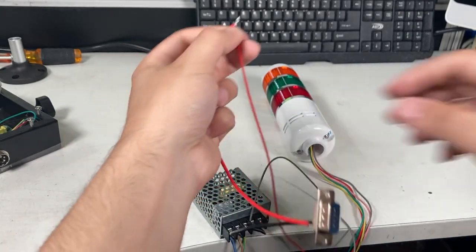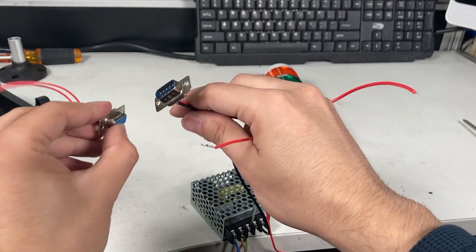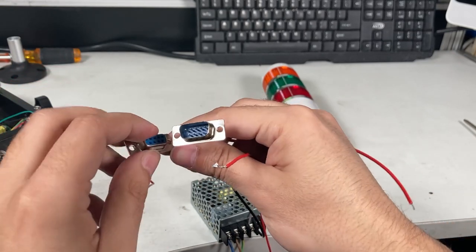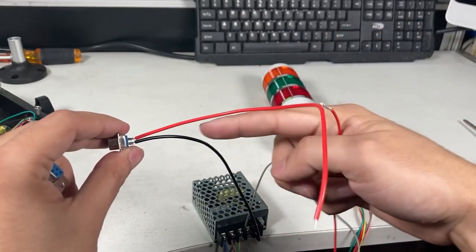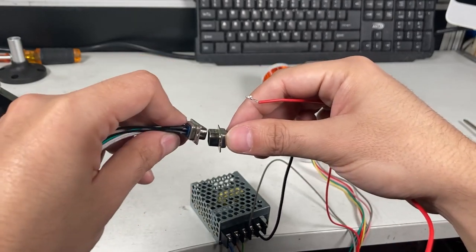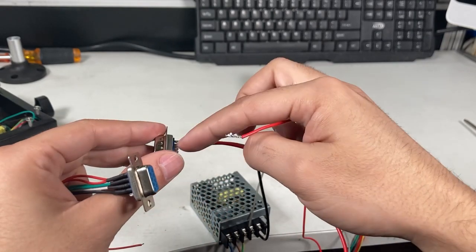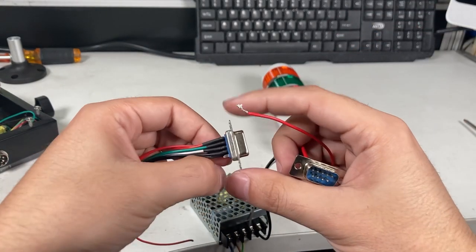So that's the idea, where once you connect these two together, from the indicator side, when it's plugged in and it notices, okay, you're going over, it's gonna close the switch here, and it's gonna send closing these two switch here on 1 and 6, and then the overlight's gonna turn on. So it's easy to disconnect, reconnect. And if it's acceptable, then you can see pin 2 and pin 7 will close together, and then that one will go to the acceptable light and so on. So whatever weight it is.